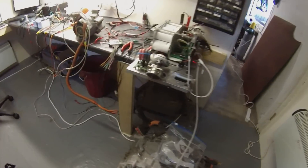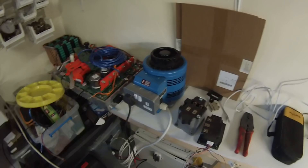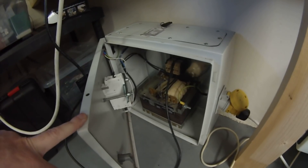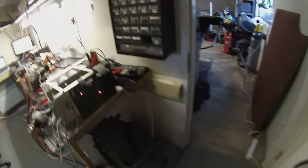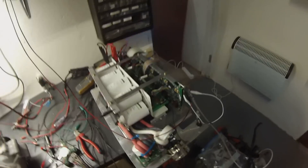Our high voltage is being provided from over here — we've got a variac connected to the 240 volt AC supply, basically set at 100% so it's just passed through. Down in this little box I've got a pretty big transformer bringing that down to about 120 volts AC. That's fed out of the yellow socket, goes into a rectifier, and is then fed into the DC bus caps. So I've got about 150 volts DC on my high voltage bus.